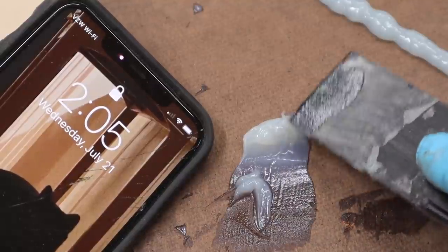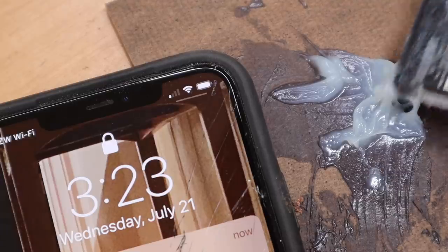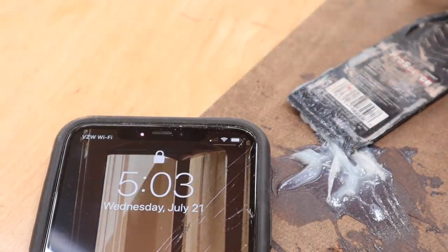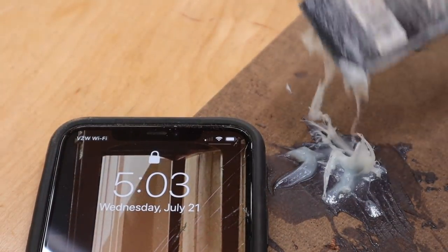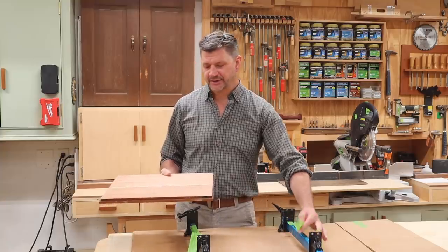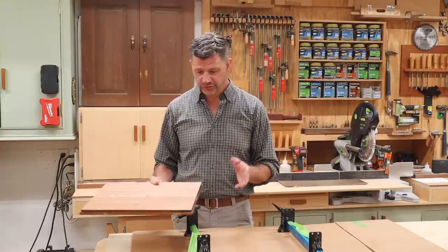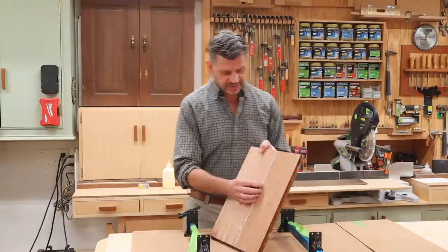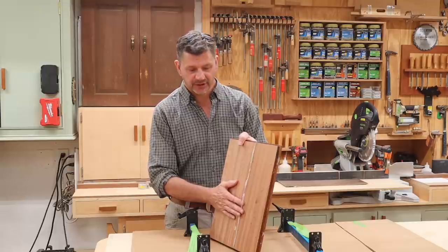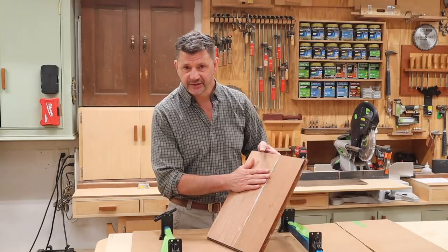As far as working time: I had been working with the epoxy for maybe 15 minutes while I glued these boards together, and I checked the consistency — still workable. I checked it about an hour and a half later — still workable. Almost three hours later it was still workable but starting to cure. So there's plenty of working time; I would safely estimate at least an hour and a half, which is more than enough for most glue-ups. Now I've got the squeeze-out on the back of the tabletop, and to remove it I'm just going to get the orbital sander and sand it off.